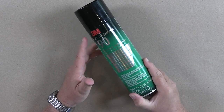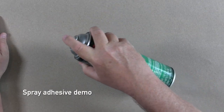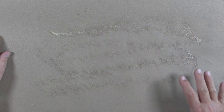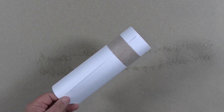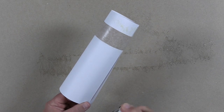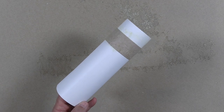Type 90 is a spray contact adhesive — you have to apply it to both surfaces to be joined. It goes on in a pattern that looks like lace or perhaps a web. You've got to resist the urge to put multiple heavy coats on the surfaces to be joined. Once the adhesive has been applied to both surfaces, we'll let the solvents flash off for about seven to ten minutes. The sheet of copy paper has been coiled up and taped to the inside of the thrust mount tube. Note the web pattern of the material as it goes onto the tube.